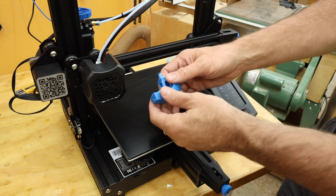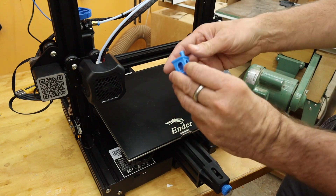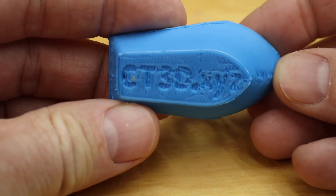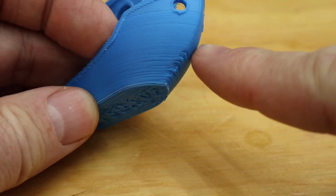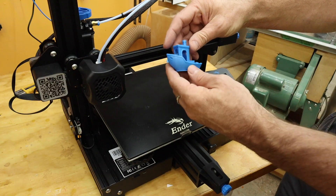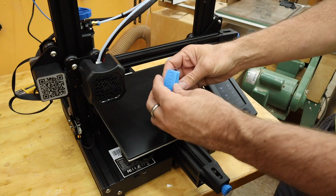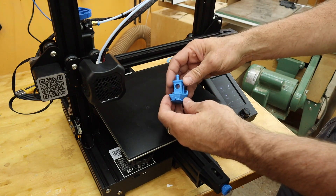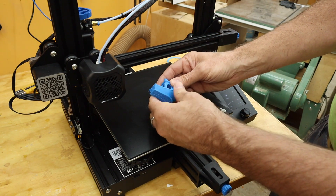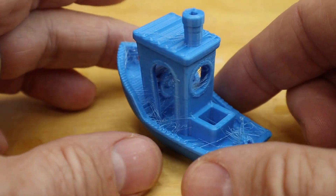I'm really impressed with how it came together. I didn't have to do much in the way of adjustments — maybe fiddle a bit with some of the wheels that slide up and down the track, as explained in that video. But the majority was already assembled. This is item number three: the Benchy model. It struggled a bit at first getting going — some issues on the nose and a visible line — but not bad. This one I did with PrusaSlicer software; the previous ones I'd done with Cura. It was suggested — thanks Dustin — that I try this instead.